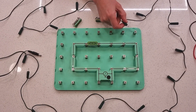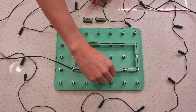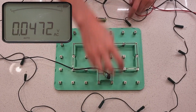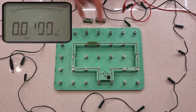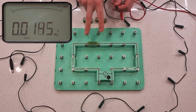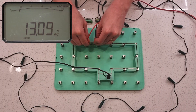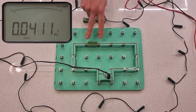There's no real connection between this being 18 ohms and any resistance inside the lamp — it's just that I happen to have three of these to illustrate this point. I'm going to plug in the voltage now and measure the voltage across these two terminals. As you can see on meter cam, we've got about 13 volts. I'm just going to quickly unplug that because this resistor doesn't have a very high power rating and will start to burn out if left connected too long. So we've got about a 13 volt supply — and if we measure across this single resistor, we get the same value, just over 13 volts, so the whole of the supply voltage is appearing across the resistor, as you'd expect.